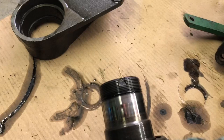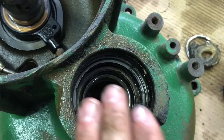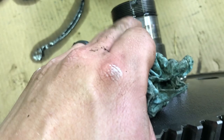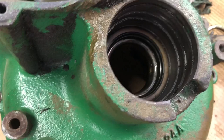I'm going to set this for now — I don't want to ding that bearing on anything. So we're going to lean that up there. All right, guys. So what I've determined is I'm going to have to take this snap ring out that I was talking about earlier in order to get this seal out. There's an O-ring right here — that's what actually seals on the outside of the output shaft bearing. Your big lip seal here — that's the main seal, honestly. And then our O-ring right here is basically sealing between the spanner nut and this shaft here. So we got that snap ring out of there. It's a little bit of a pain just because there's the snap ring groove it's in, then there's the O-ring groove, and then there's this snap ring groove — so you've got to get it through all three of those grooves, but it's not the end of the world.